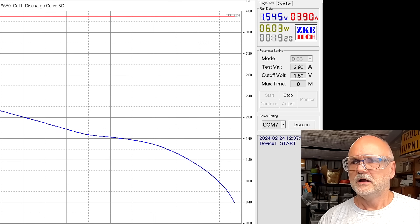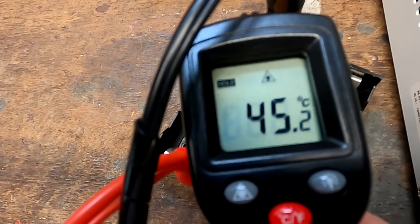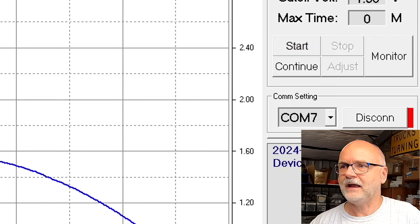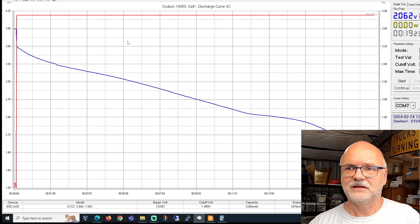It'll be fine — we've already discharged 1.1 ampere-hours so it will stop very soon. The cell just needs to deal with it. We are close to 1.5 volts and discharge has stopped. Temperature: 45.2 degrees Celsius at 3C discharge — from 28 to 45 degrees, just within specifications. You can still touch it but it is hot. Result: 1.26 ampere-hours, discharge took only 19 minutes. 3C: safe.